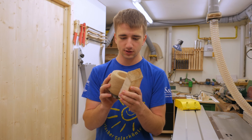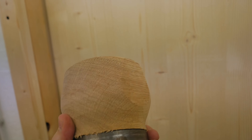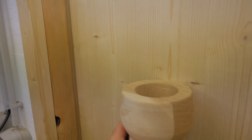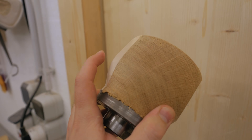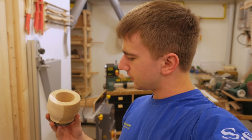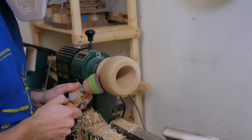Now I have a bowl with the hole and the block, and I'm curious how this will turn out — I really don't know where I'm going with this. Right now it would get mounted with this flat spot to the wall, like so. It kind of looks cool and interesting but also a little bulky. The problem is I can't turn away a lot of material here because then I'll lose the flat spot, so I'll just keep turning a little bit longer.